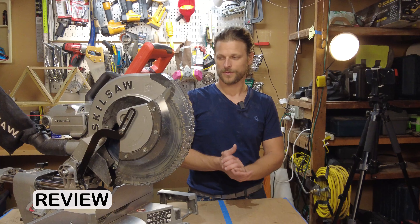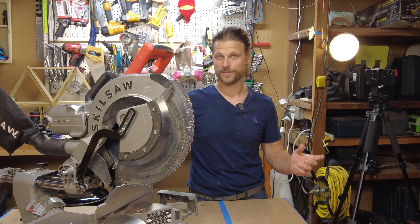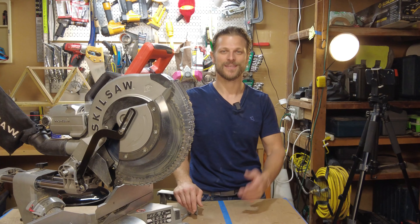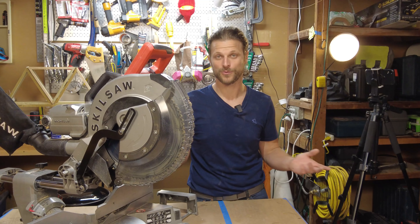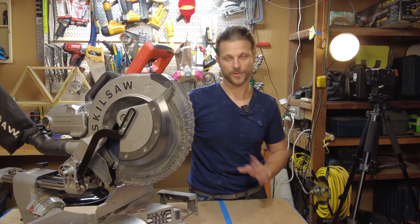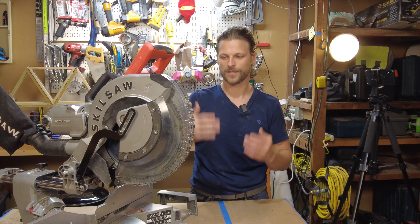Overall, do I like it? I like it a lot — it's done everything I've asked it to do. It's even cut through six-inch six-by-sixes, treated lumber, no problem. It's very powerful, but it's also very cumbersome — about 60 to 65 pounds. I like having more tool than I need. The sawdust extraction is poor, so don't plan on it saving you any clean-up time. It is worm drive, which is one of the reasons it was expensive — worm drive produces more torque, which is why it can cut through that six-by-six no problem.